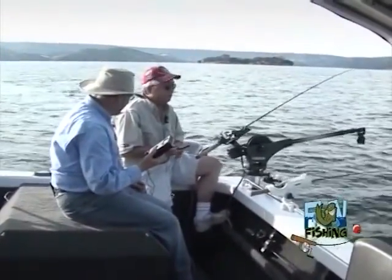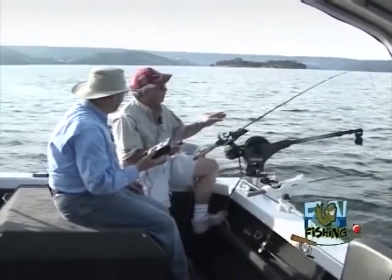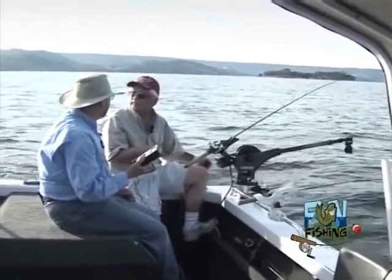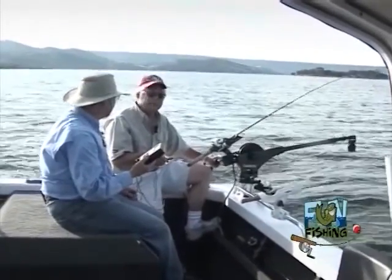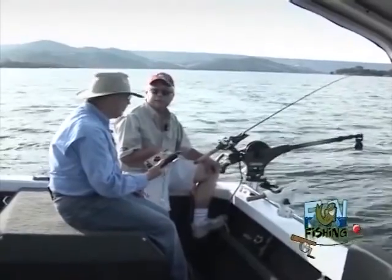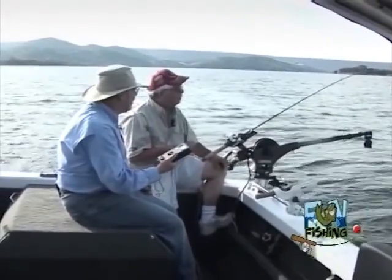And the correction would be to go buy a box. They have these boxes you could put on there, and you adjust it, and you would reverse the field to a positive field. But very important. That's really one of the most asked questions: how do I know if I got a hot boat? We just showed them how to check.